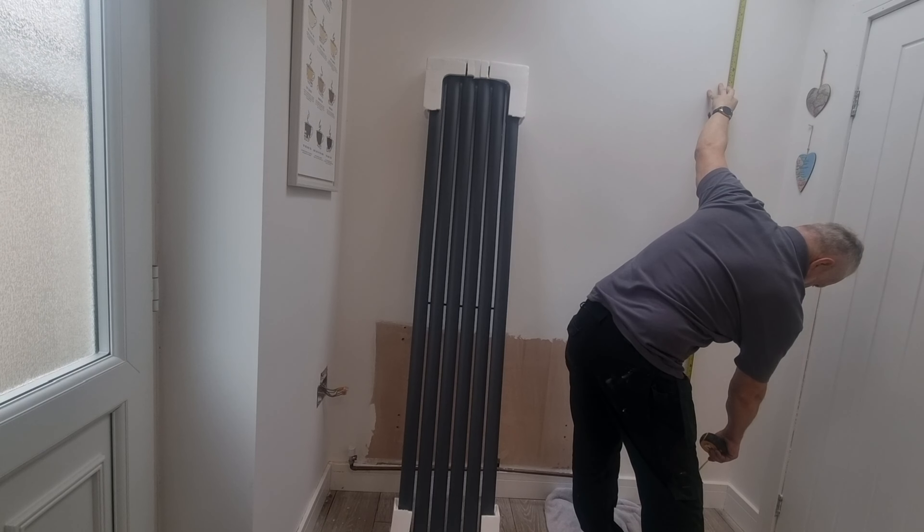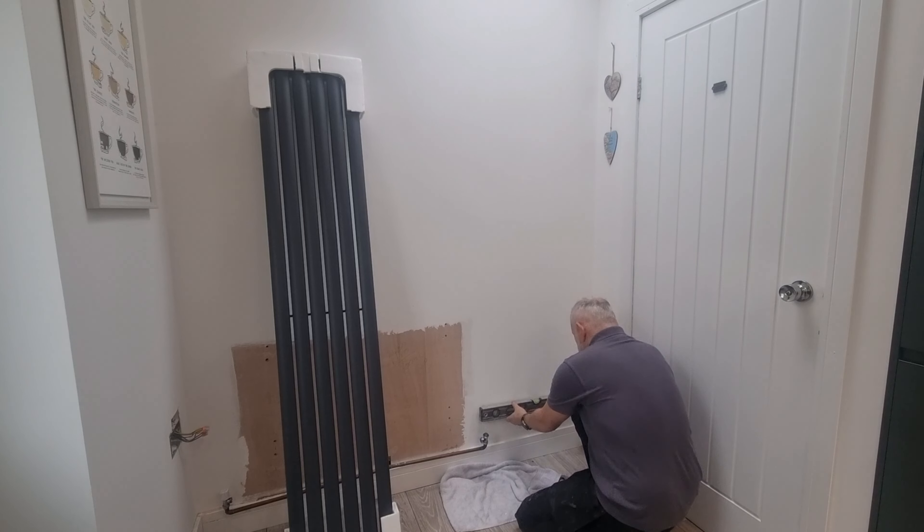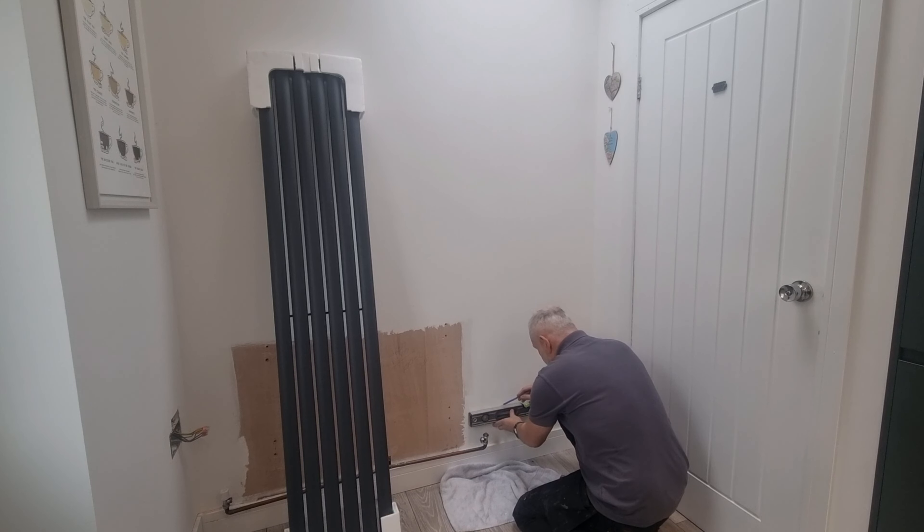Size of the radiator is 1,880, which leaves you 600mm. So what we want is: 600mm divided by 2 is 300, so we want the bottom of the radiator at 300, top of the radiator with 300 down from there. So we'll start by getting that measured out — mark 300 and 300, just mark the level across.